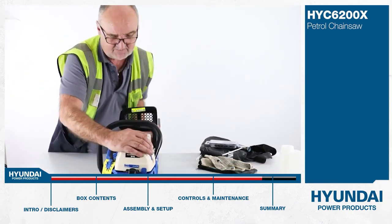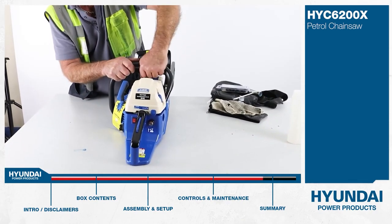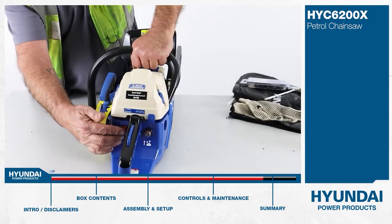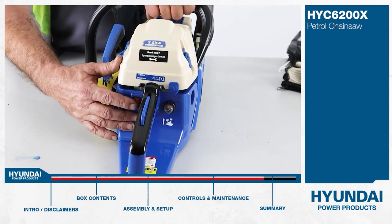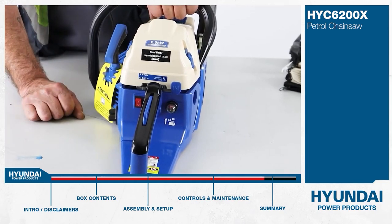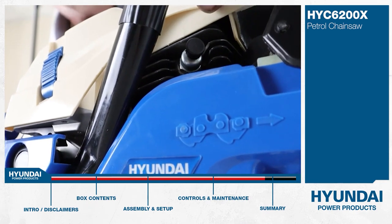So just throwing in a couple of safety tips while we're at it. If at any time you want to stop the chainsaw, put your chain brake on, let the engine come back to idle if you've been revving it hard, let it idle back down, and then just switch it off on the switch.